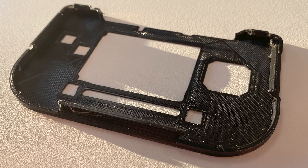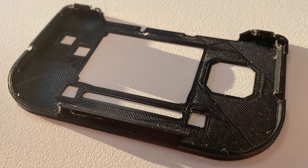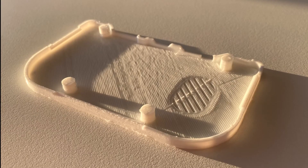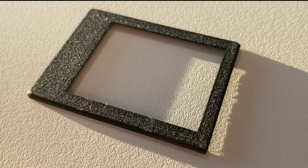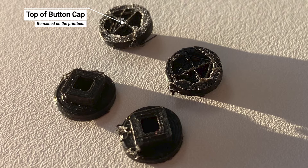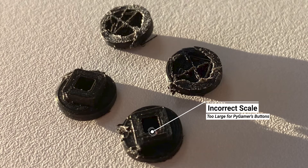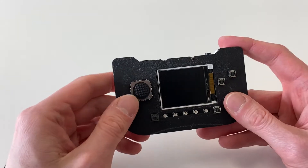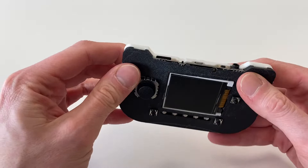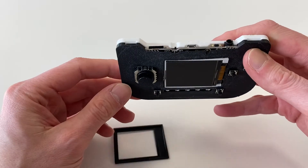If we take a close look at the back of the print, you can see it isn't so neat and requires some trimming with a knife. I couldn't get it to fit the board without trimming around some of the cutouts first. The bottom came out fairly well but also required a little trimming. The bezel turned out okay, but the buttons were a complete disaster — they had stuck so much to the print bed that the plastic gave way when I attempted to remove them. As it turns out, they are scaled wrong anyway and don't fit the PyGamer's buttons. When I attempted to assemble the unit, I found that the snap-fit wasn't that great, probably as I had printed without any supports, and the design had no way of snapping the bezel into place.